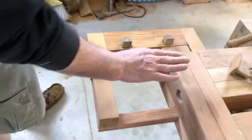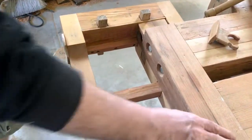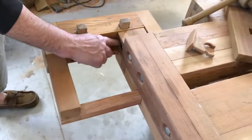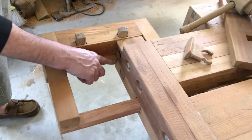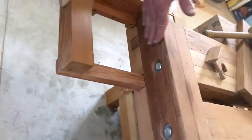If you look at the vise, one thing I'd look out for if anyone was to do this themselves — something I didn't think through as well as I could have — is the end cap. It's only as thick as the bench, and by the time I drilled it and tapped it for the screw, I did not have a whole lot of meat left.